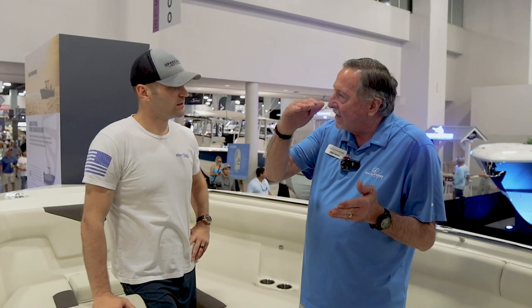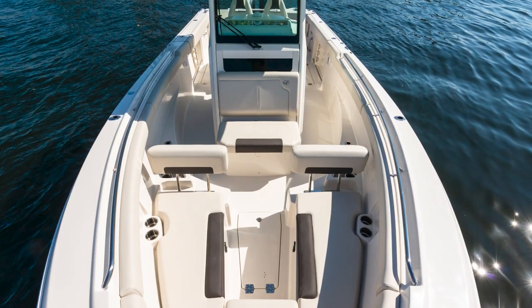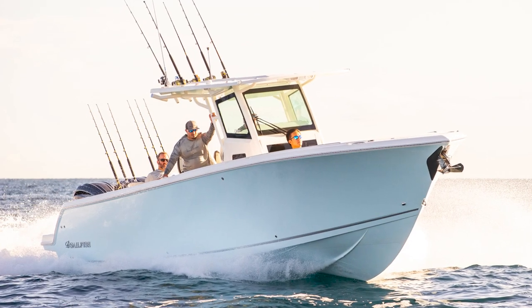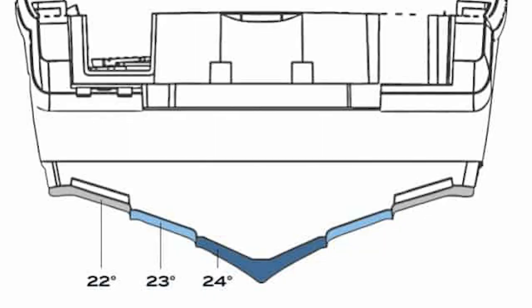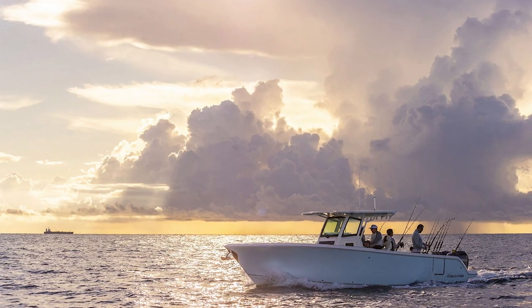In terms of vehicles, the mid-level tier is like a Chevrolet, but the 312CC is more like the Denali — not quite Cadillac, but right up there with more features, benefits, and styling. Their hull is also unique: it's a variable degree stepped hull that's constantly changing. At 24 degrees it cuts through rough water for a smooth ride; at 23 degrees at cruise it gives the best fuel economy; and at 22 degrees it gives stability at rest, so when you're out fishing you're not rocking on a 24-degree bottom.